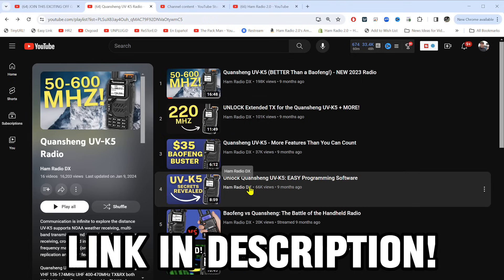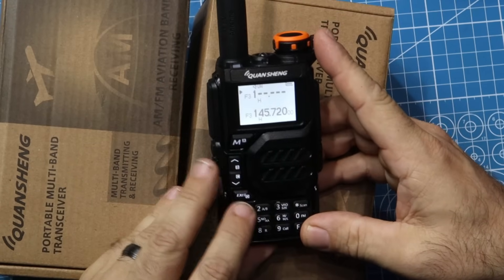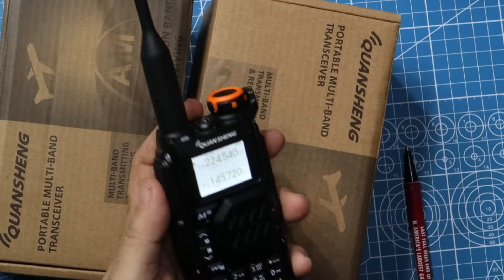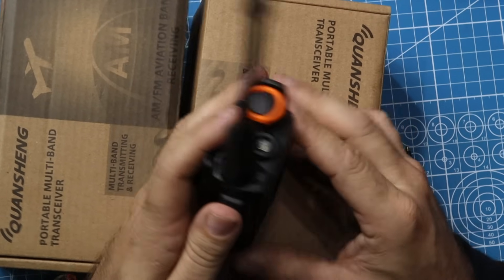I will put a link to that in the description below. What I did to get to 220 — let me go back to band. Okay, 224.54. I keyed up KC5HWB testing. Got to vertically polarize it. That's the Grapevine, the Dekaro repeater in Grapevine, 224.54. I monitor this repeater sometimes. So if you're in the North Texas area and you have access to 220, tune to 224.54, negative offset, PL tone of 110.9. It's a good repeater — I do monitor it when I'm at home.